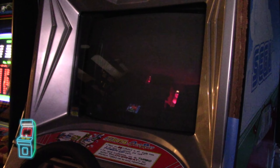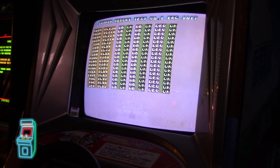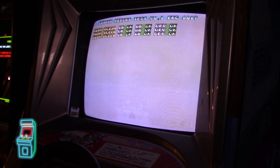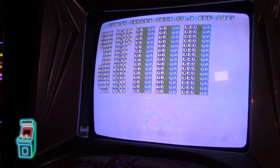We're back - I turned it on and it goes straight to the test menu with this RAM test ROM. So far it's saying everything is okay. It repeats over and over, so if you miss anything you can catch it again. It's giving me an error on Sprite IC51. Restarting - and it looks like those memory slots are fine: 55 and 56 are okay. It's having a problem on Sprite IC51, which is on the second board.